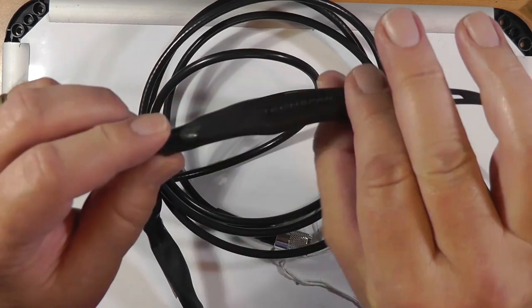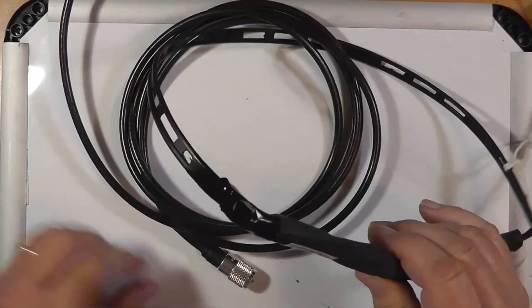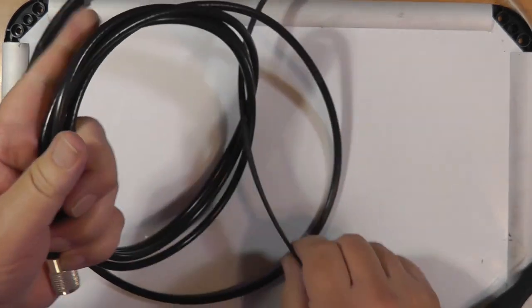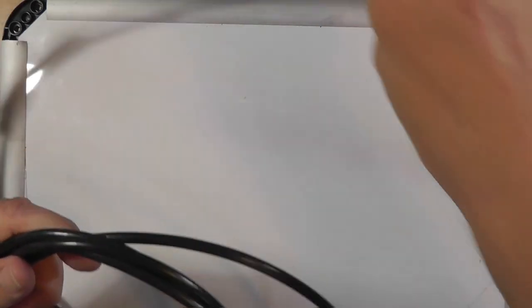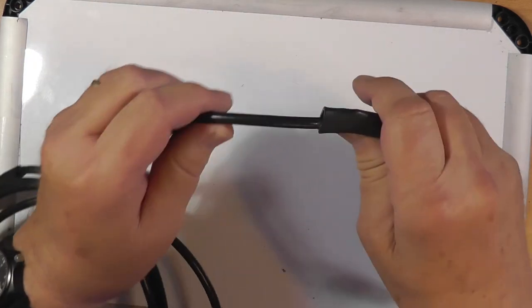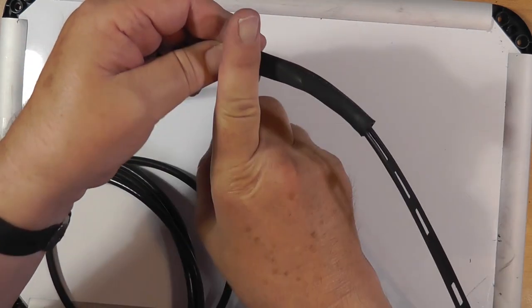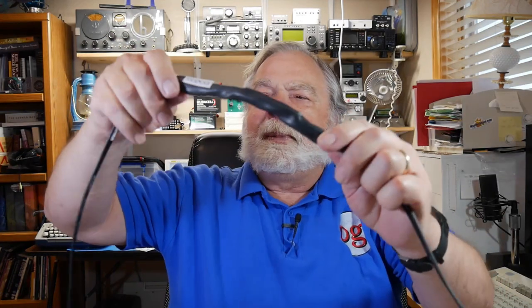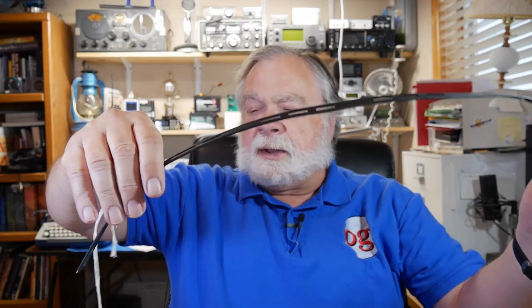Now, I have covered up all the stuff in here that went with making it 2 meters, and there's some more right here. But if we look at it from the overhead, there is a cable. Now note that this is a PL-259, so you're going to have to get the adapter to your radio. Okay, and then this comes up to the bottom right here where it attaches, and it's kind of hard to see up under there, but the actual cross connect is about here, and then it comes up about here to actually feed it. And then this part right here is the part that makes it two bands, and then there is a string on the end. And you can attach this over any tree limb until you've got this entire thing vertical. The coax doesn't need to be vertical, it can attach to your handheld.